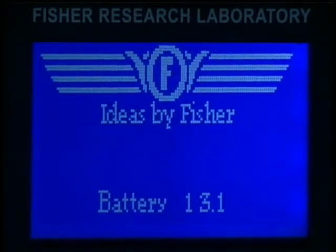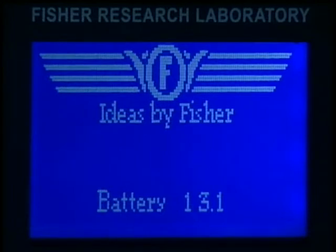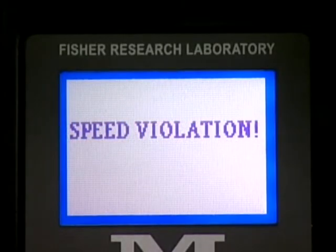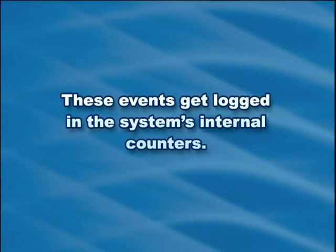If the rate alarm is not set to disabled, a subject taking too long, more than 7.5 seconds, to exit the MScope will also cause a speed violation. If the subject exceeds the MScope selected speed limit, the LCD displays speed violation. The audio alert sounds, the zone lights flash red, and the bar graph and ready LEDs flash several times. These events get logged in the system's internal counters.